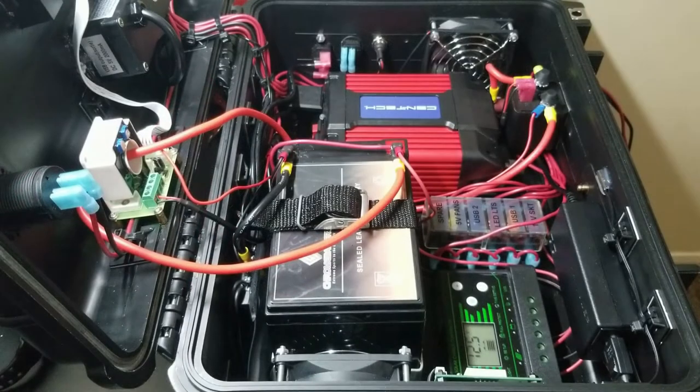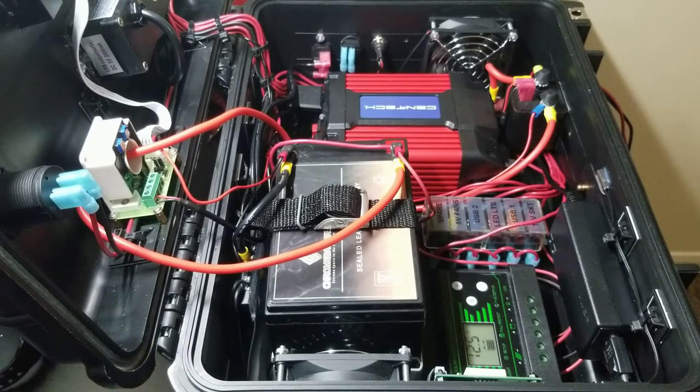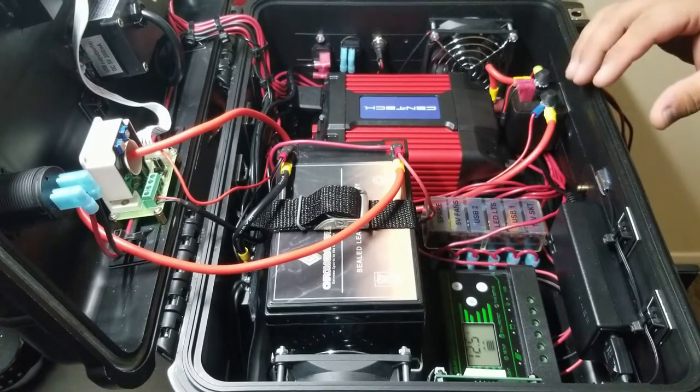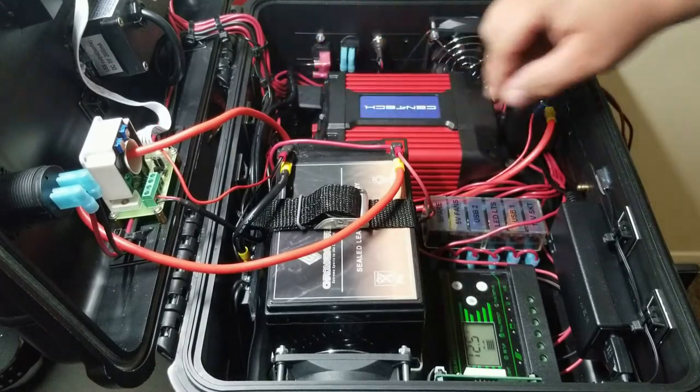So now we're back. We left off at this battery charger, and now it's been 2 days since I installed the battery charger, and since then I've drained the battery twice and recharged it. It's done very well. It reaches the float charge voltage, and it just stays there. It doesn't go down or up from there. So the charger is doing really good, and now what we're going to do is finish up the wiring, clean it up, use some tie wraps against these sticky backs.